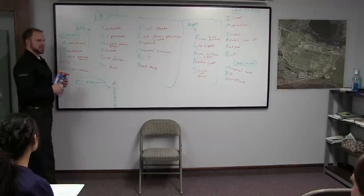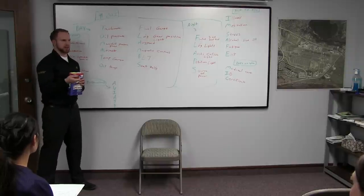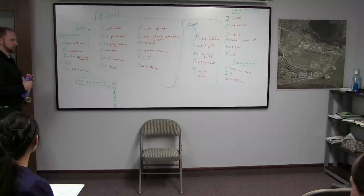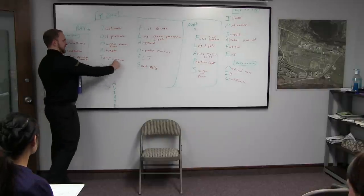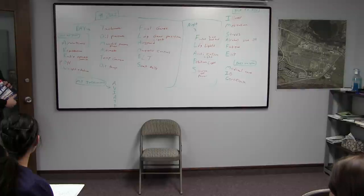You must disconnect and placard inoperative for that device. So you need to pull a circuit breaker for the flaps. You need to actually go in and pull some wires from the back and have a mechanic or somebody verify that they're capped off, and then you need to actually take, we use like the little label makers, and put "inop, flaps inop," or something of that nature. That way whoever's flying it next knows that there's a problem, that they're not going to have their flaps.